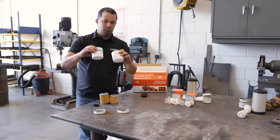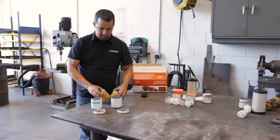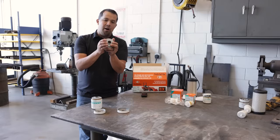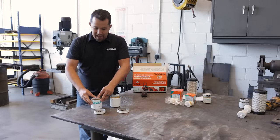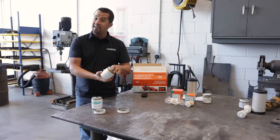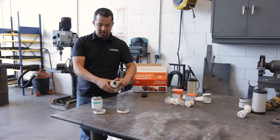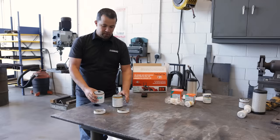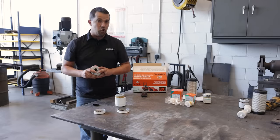In the bottom of the cans there is a pressure release for the drain-back valves — same function as in the engine filter: if this plugs up, it can push down to allow oil to bypass. And here we have something completely different. The aftermarket filter has a lot of springiness and can drop down in easily, while the Kubota filter has very, very little give — meaning the aftermarket filter is going to bypass a lot easier than what the OEM filter is intended to.